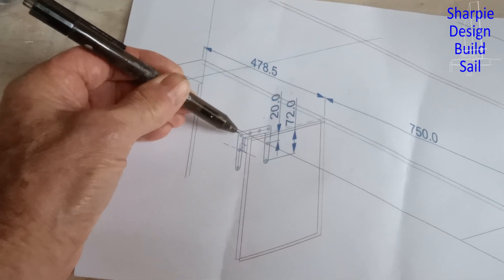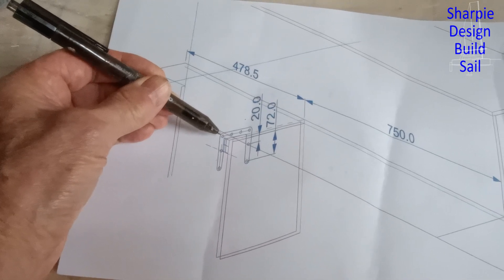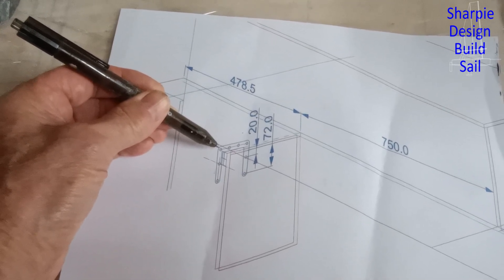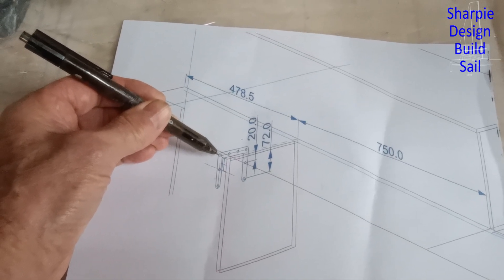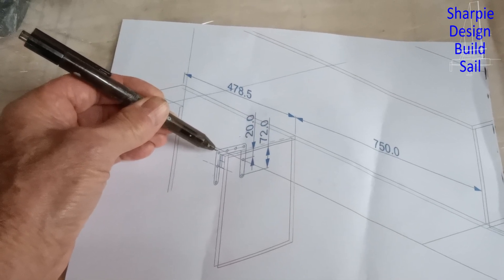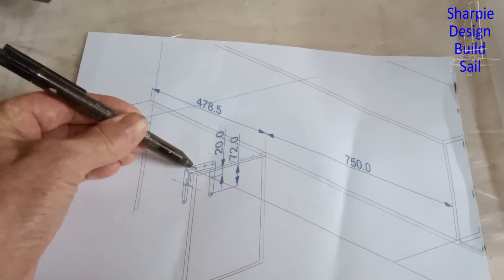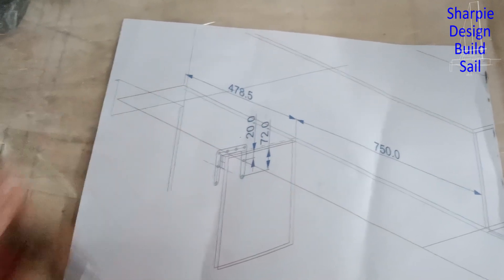I've got these extra holes here because I'm going for the minimum purchase, since there are two sails and I'm trying to second-guess how much load there'll be on them. It's easy to see what you'd use for a normal boat but for this one it's a bit different. You're not exactly halving the load by having two mainsheets to a two-ply sail, but I don't want too many running lines. In case I blow it and the purchase is not enough, I can run an extra block down here and add to the purchase.